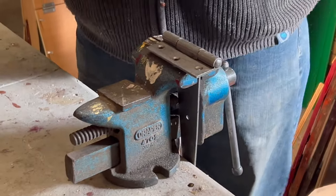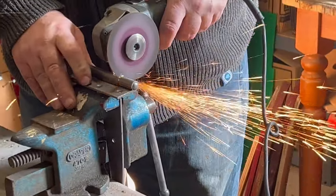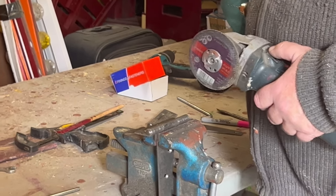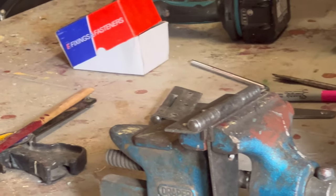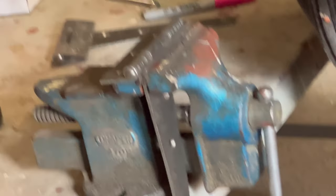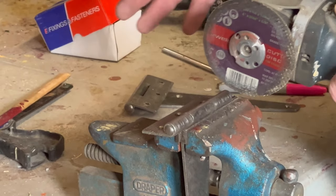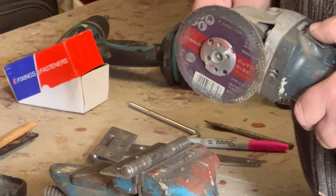The sparks are going towards me — they're going everywhere. Just moved a bit there, a little bit close for comfort. What I would say is if you don't like using an angle grinder, a good old trusty hacksaw works fine — you can do exactly the same job, it just takes a bit longer. The good thing about the grinder is the thickness of the blade cuts a bit off, so it makes it a little bit sloppy and you've got a little bit of movement. If you're cutting with a hacksaw you might have to get a file on it because the hacksaw blade is a bit thinner.